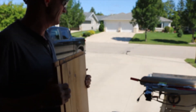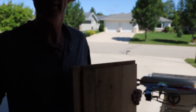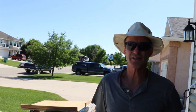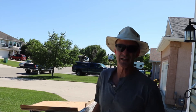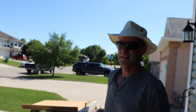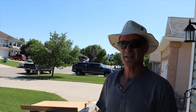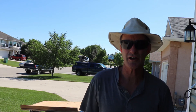Oh well, lesson learned — I'm just going to change my blade now and cut this off. That's how you use your dado blade: put a piece in here so your fence isn't right against the blade — that works for everything, straight cuts and all. We'll do the other piece. The important thing with a dado blade is that you practice on a few pieces of scrap wood first.